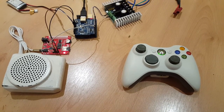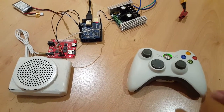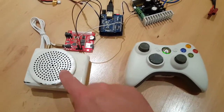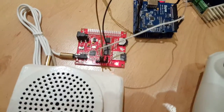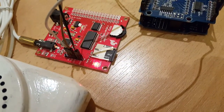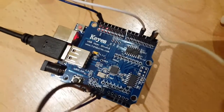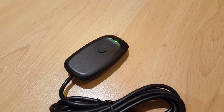This is a quick video to show how the Padawan 360 control system works for R2D2 remote control. We've got an Xbox standard controller, an Aker amplifier for demo purposes, a SparkFun MP3 trigger board with a two-gigabyte memory card pre-loaded with R2 sounds, an Arduino Uno at the bottom, a USB host shield, and a USB connection going over to the Xbox remote receiver.